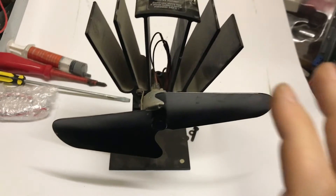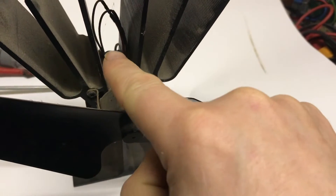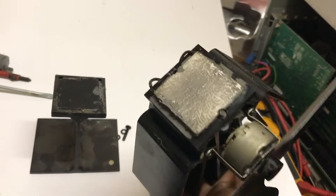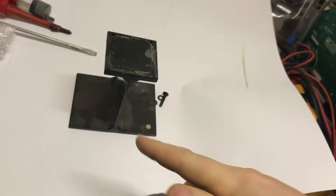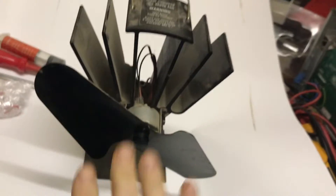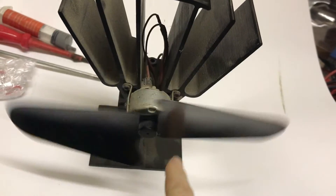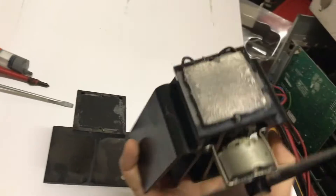These little fans work on pure magic — there's no battery, but somehow they're able to work. I'll lift the lid so we can see behind the curtain. This is the peltier — basically a peltier battery. What it does is take the heat from one side; the top half is colder, so one side is hot and one side is cold. That difference creates a voltage and a very small current, and that's actually enough just to turn the fan. That's how it works.